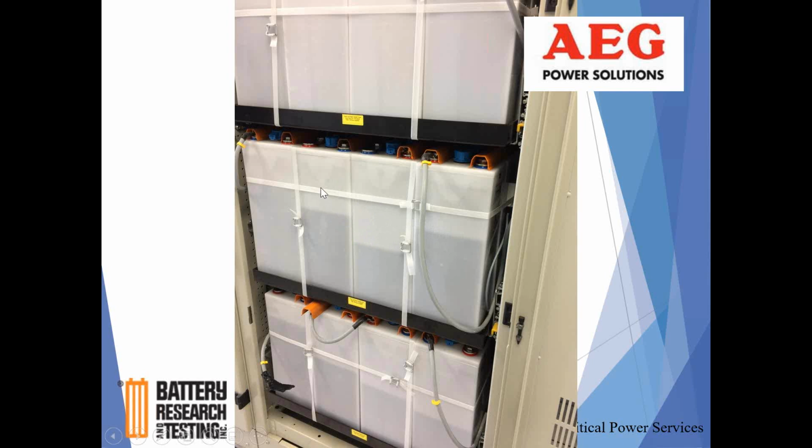This is an issue where the electrolyte was allowed to get too low. The plates became exposed. As the plates became exposed, the cells themselves start to heat up. They get hotter. They off gas more, driving the electrolyte even lower, exposing more plate. It's called a thermal condition, or you may even have heard the term thermal runaway.